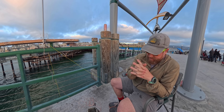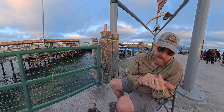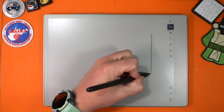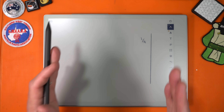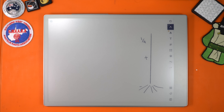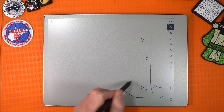First, to make this a bit easier for everybody to digest, let's go back to the ham shack. I've got a bit of a drawing to walk through with you so we're all on the same base level. We've been playing around with the idea of a vertical antenna in the last couple of videos. This is a one-quarter wavelength antenna, meaning the length of this antenna is one quarter of the actual representation of the wavelength, and then you've got radials underneath it. Looking at a coax, the pin is the center and the shield is the negative — those are the two sides of the antenna. It's effectively a half-wave antenna when you incorporate the radials underneath it.